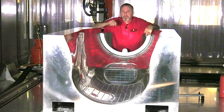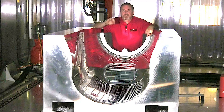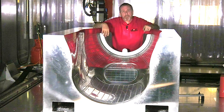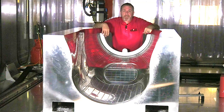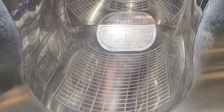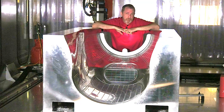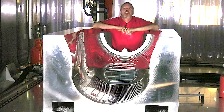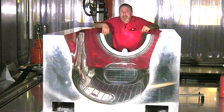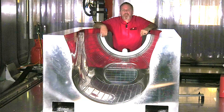There's more — it's close, but not quite ready yet. We're working on a new, we think much better, certainly much simpler approach to making molds for the plastic processes I just mentioned, using cut layer additive. It supports all the basic functions these processes need, but in a different way: air vents for blow molding, a new approach to vacuum for thermoforming, internal fluid lines for temperature control that accurately follow the contour of the mold face — and all done at lower cost. Can't get into details right now, but it's pretty amazing. We'll let you know when it's ready, but for now let's focus back on thermoset parts.